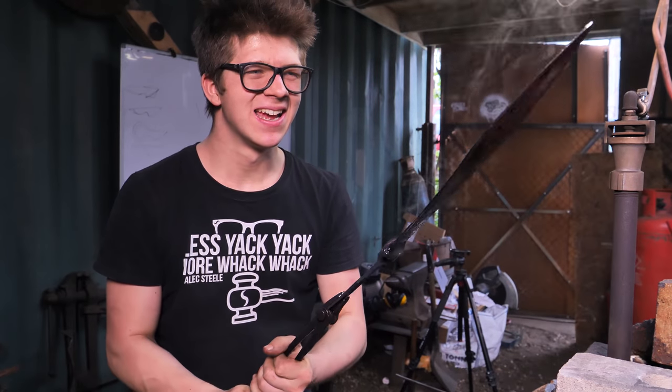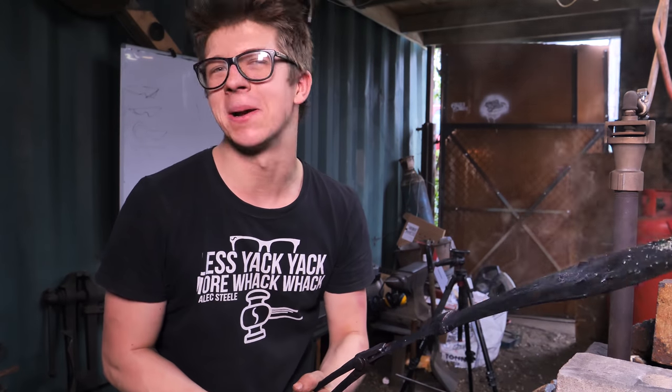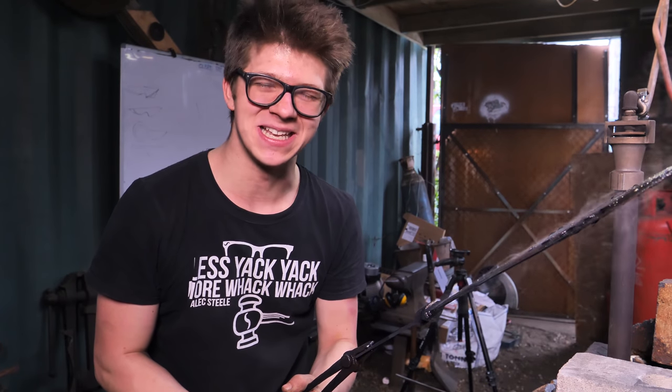Straight. This is great. I'm really excited. Now, my tempering oven isn't big enough to fit this, so I'm going to run home to the apartment and stick this in the oven and give this a little temper at about 200 degrees Celsius for a couple of hours.